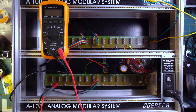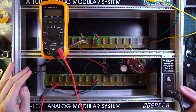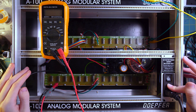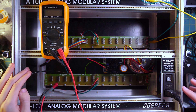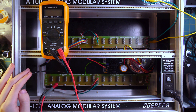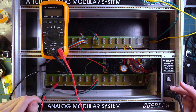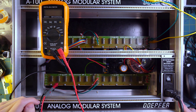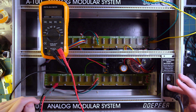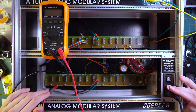I think I know what happened. The power strip I was plugging this into had a loose connection into the wall socket, and when moved around it probably caused some sort of arc that blew the fuse — which fortunately protected the new power supply. When I then tried to plug it in after replacing the fuse, that same power strip still had a loose connection and wasn't actually delivering power. Switching to a different power strip fixed it. The reason I didn't realize this before is that when I switched plugs earlier, the fuse was still blown — so I assumed it wasn't the power strip.